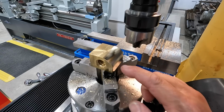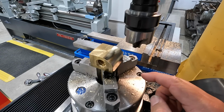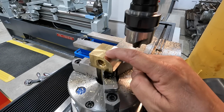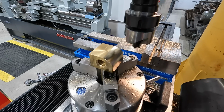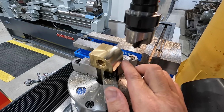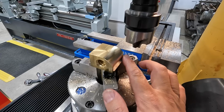All right, that looks pretty good. It's actually got a pretty nice finish on there too. It is an older used cutter, but it still did a pretty good job. We could probably fudge the Z a little bit, maybe a couple thousandths, but I don't think it's worth going in there, and then it might start cutting into that. So we're going to leave it right where it's at. I think our elevation and our Y-axis offsets worked pretty good.